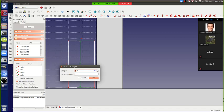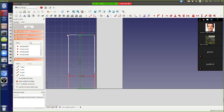side to side. You want to use a straight edge, the speed square, to mark a line straight up and down, and then you're blocking like for the second story platform. Make sure your joists are straight up and down. Here, I guess, we could do like a 10-inch piece or up to 11.25, so it's not sticking up or down. But like 10-inch, let's just say 10-inch pieces. Okay, so 3.5 here.